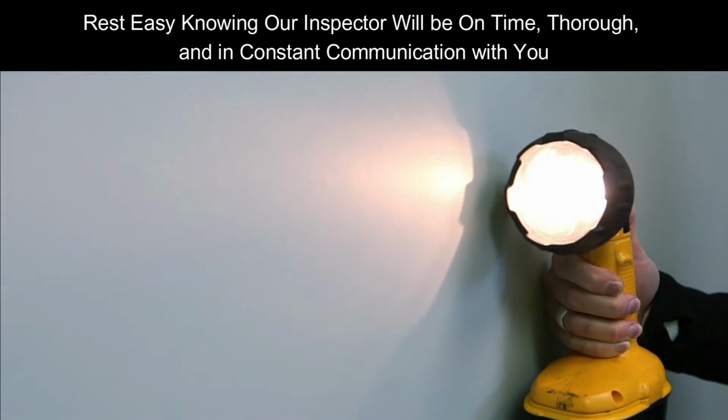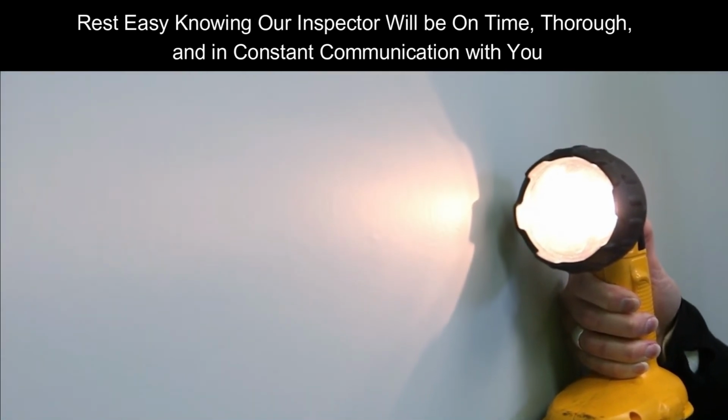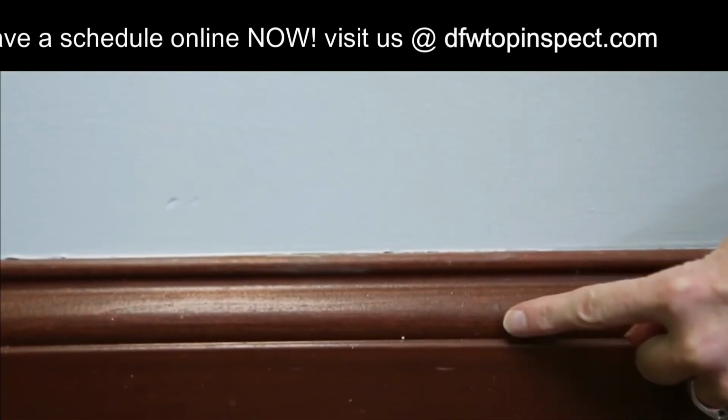If you don't have a stud finder, take your flashlight and hold it close to the wall. See if you can find where the light changes. You may notice a difference in wall texture as well. These would be the drywall seams, and drywall should be screwed into a stud. To confirm this, go to your baseboards.